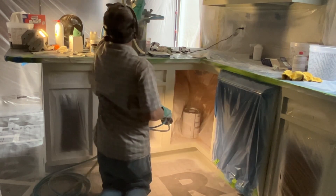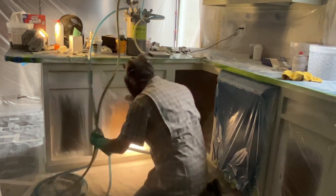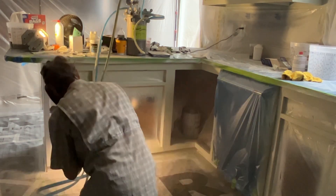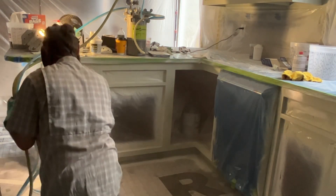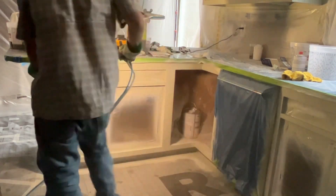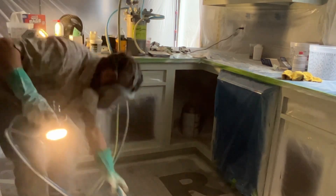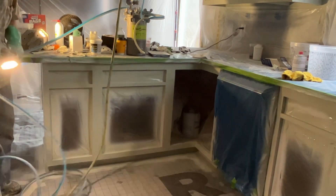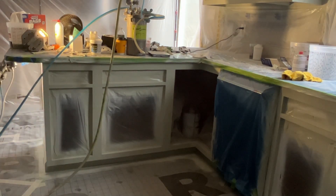The other issue I had — I just didn't seem to be getting enough paint. As I was playing around with the pressure settings and turning up my pressure, I still wasn't getting a lot of paint. It seemed strange because you should be getting paint at about 10 to 15 PSI no problem, but I was above 20-25 PSI and barely getting anything, until I realized there was a little kink in my hose. It's a cheap dual hose where the air and fluid line run together, and it kinks pretty easily right where it comes out of my pressure pot. I had to undo that and put my hose in a position where it wouldn't kink, and then it worked no problem.